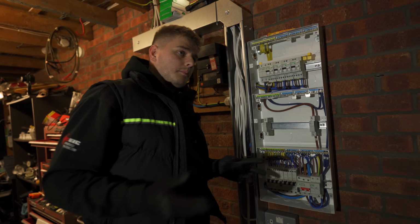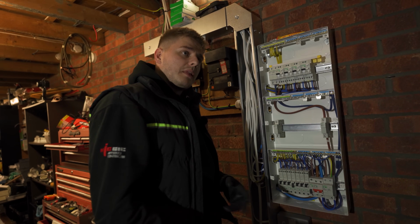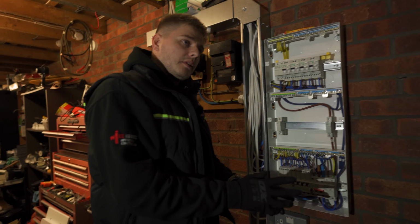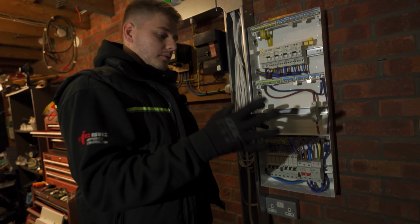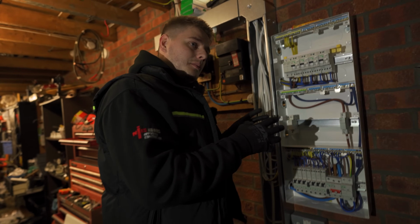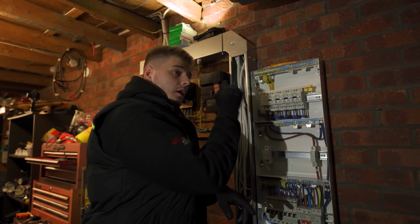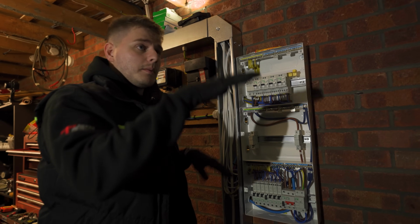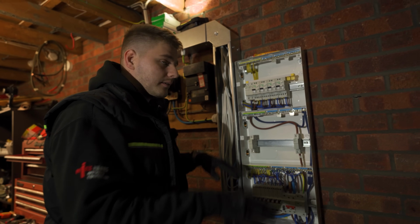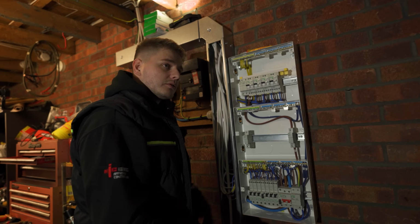And then immersion heater goes in there, and they go, oh, well, there's valves in there and we need to control that and we need to fire the boiler. So we'll put it all in the airing cupboard, but we need to tell the boiler to fire. So the boiler's on the kitchen ring, but the immersion, which does the central heating controls and everything, sends a switch live to there. And basically this is going, hang on, I've got an imbalance because I'm measuring current on, which is coming from another source. So, and that's why it's tripping.